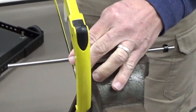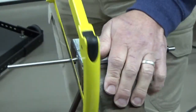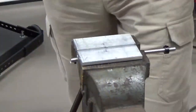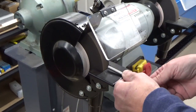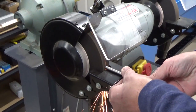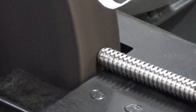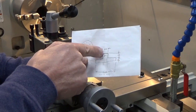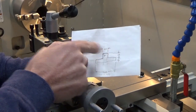So I've got it set up in the vice now, so we'll just cut this end off. Now I'm just going to give that a touch up on the grinder and round it off a bit. Basically we've got 40mm to 44mm across we can go on the wider part, and then we're going to turn that down to 20mm for this area here.